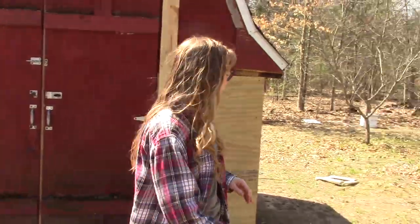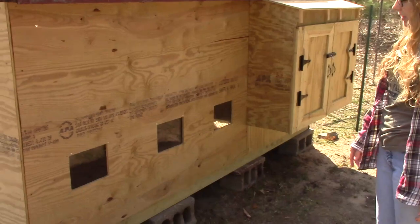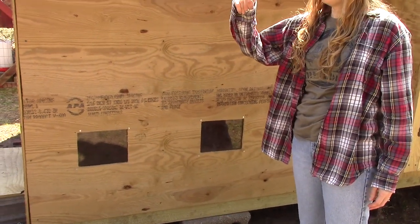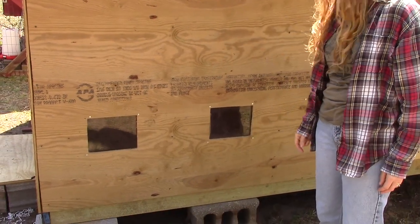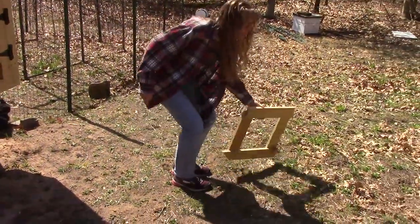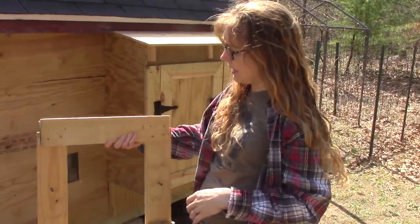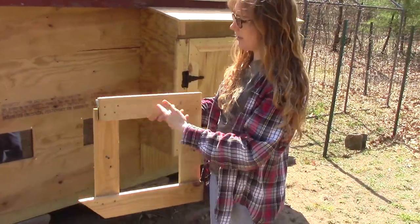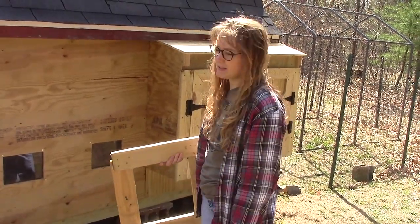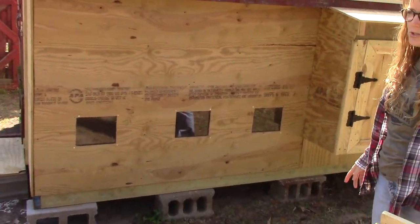If you follow me around this side, I did put in some windows for the chicks. We had some scrap plexiglass — quarter or half inch, I can't remember which — and I used a roto zip and made a template so I could level it and screw it on each spot, running the roto zip in there so all of them are about the same size. Not perfectly straight lines but for this it doesn't matter. On the other side there are windows as well and I can show you those in just a minute.